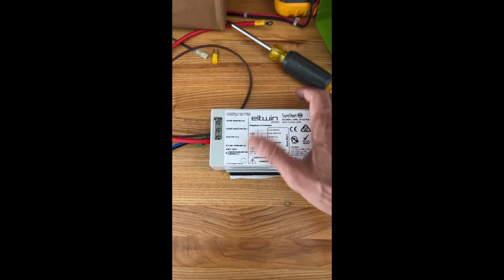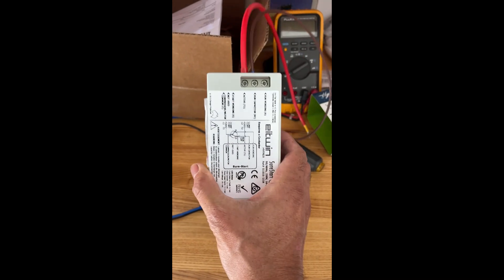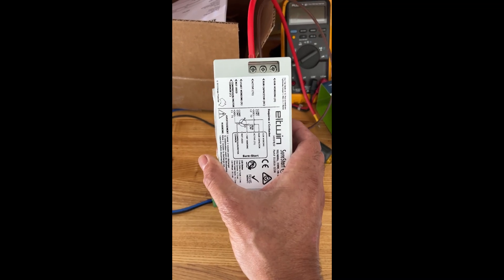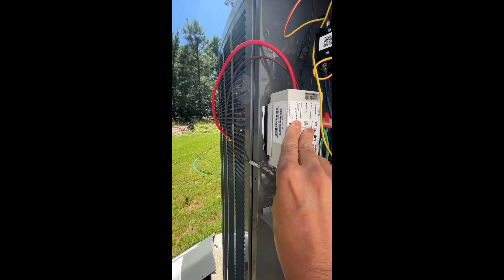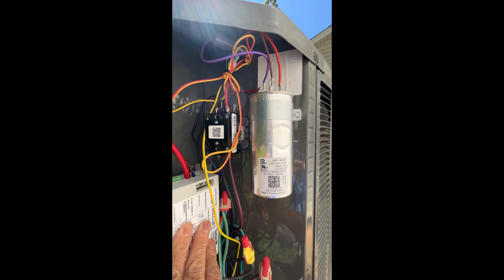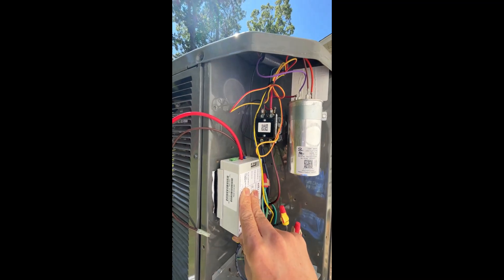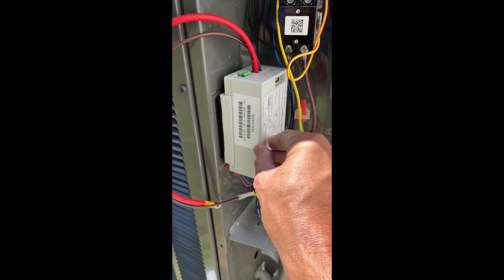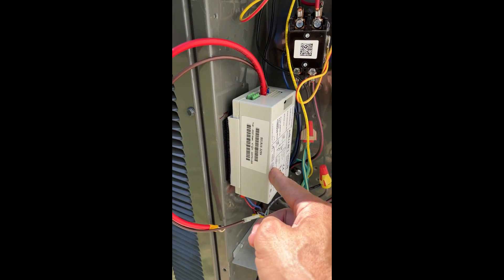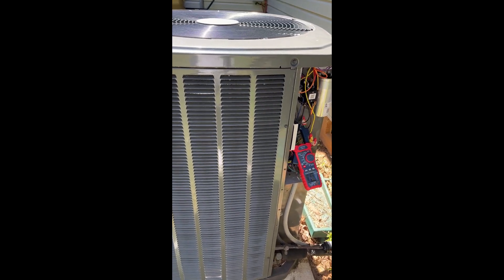My next step is to go to the unit and dry fit it. I have a feeling it's going to be installed facing upward. Just a quick dry fit to get a good idea of where it's going to be placed — the cable should be long enough to reach both the contactor and the capacitor. This is about the height I'm going to install the soft start. It looks nice and secure, and I can snap it off at any time. I'll take it back inside to review the electrical diagram one more time.